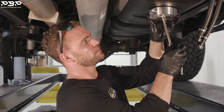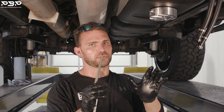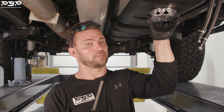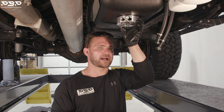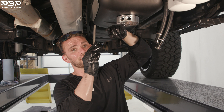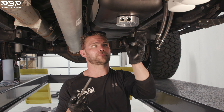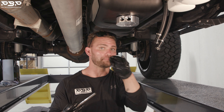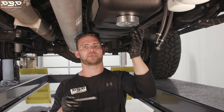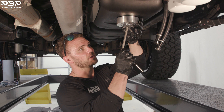What I always do is press up on the sump and turn it to the right. You do not have to get it tight yet — this is where you want to orientate the sump. We just ran into a roadblock, but not really. What's happening is the stand pipe is up in the sump hitting a bridge up there, so when it rotates, you can't turn anymore. Simple solution — you've got two options: you can drop this unit out and shave the return pipe, or if you don't have anything to shave it, that's perfectly fine. Just reach up here, turn the sump. Now you're ready to route your hoses. But first, let's go ahead and torque this sump down.